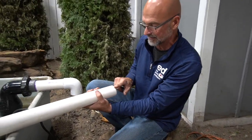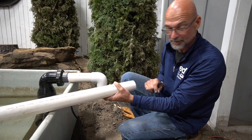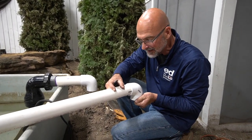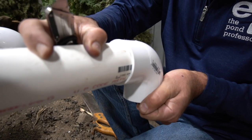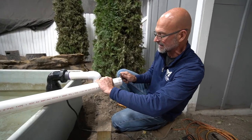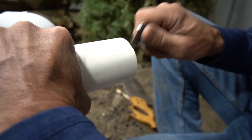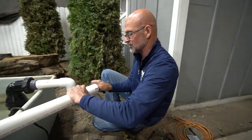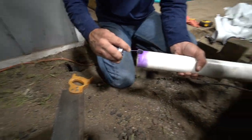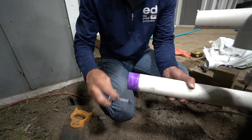The things I'm always doing — you can see I have all these burrs on here because I just cut this piece of pipe. I have a lot of cuts to do, but all these little burrs could cause problems because the tolerances between the inside diameter of this coupling and the outside diameter of the pipe are very, very tight. You can see right now it does not even want to go on — I cannot push it on there. Obviously I don't have glue on there yet, which acts as a lubricant. So you're going to want to come through with a file to round that edge off. When you're doing your cleaning, go all the way up to that ridge inside of there. All you need to do is go right to the tip of your finger — there's no need to go way back. Try to do enough, but not to overdo it.